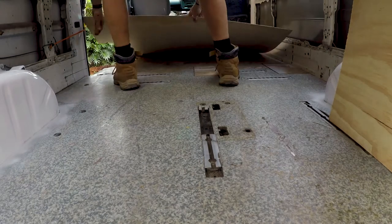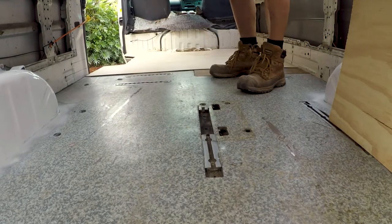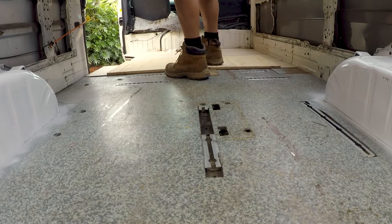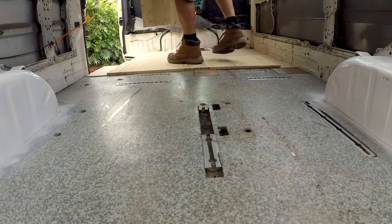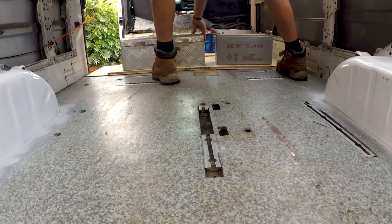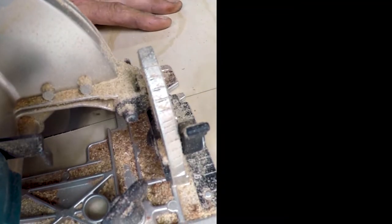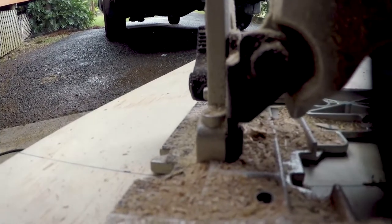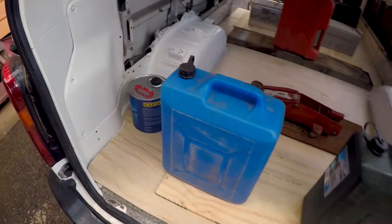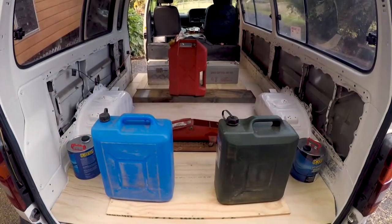So that when the other board goes in, where the join in the boards are, it'll be nicely glued through there and it won't show up through the vinyl. Now I'll drop the board down, get it in place. We're going to put a heavy bit of ply on top so we've got the edge there, make sure we're glued down well on our join, and another bit of ply up the back and a little bit of weight on those while the glue sets.